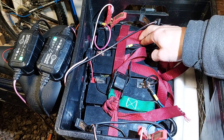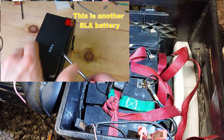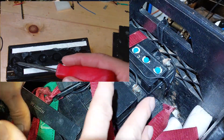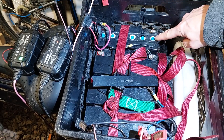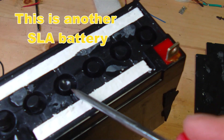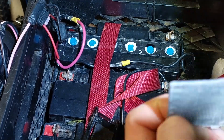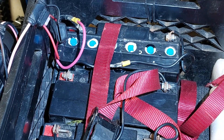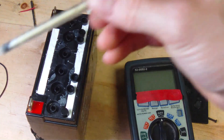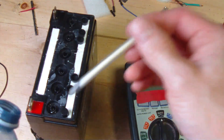When I discovered the low current issue, I took off the cover. Right away I knew there was a problem. Once the cover is removed I can look at the cell caps — when I looked at these little plugs they were sucked in really, really deep. That's the indication the cell has dried out. When I popped the cap off and looked inside it was very dry — you actually want to see it a little wet in there, like a fiberglass battery mat should be. So here I'm showing adding water to one of the batteries, a small amount at a time — it takes quite a bit to absorb down.